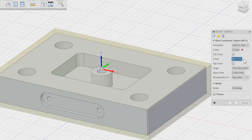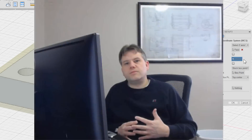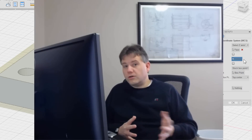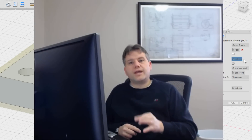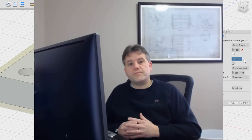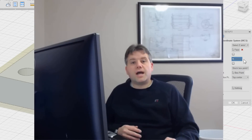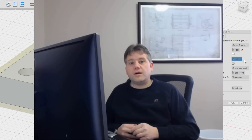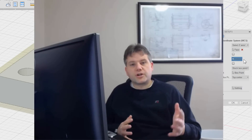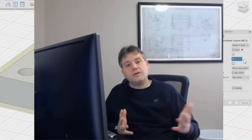The next thing we have to do is tell the machine — now that we've established what the Z direction is — where the program's origin is going to come from. When the part is sitting on the table, where is it placed? We call that the work coordinate system. Many times on your machine this will be called G54 — that's a norm where G54 is the zero-zero point on your part. If you're not familiar with that, I'd definitely recommend checking your machine's manual. With the wrong work coordinate system things are not going to work, so confirm that G54 is the right one for your machine.